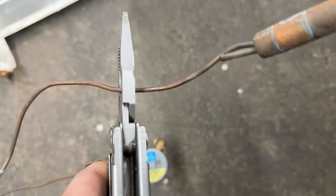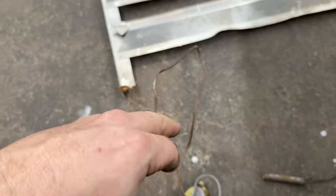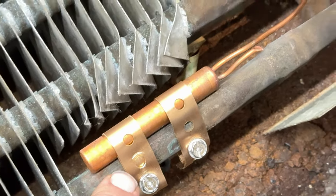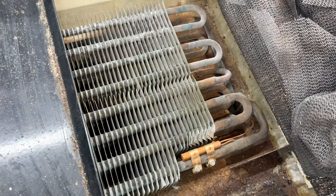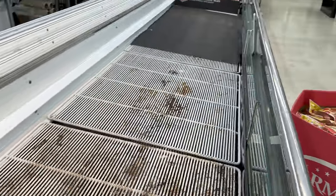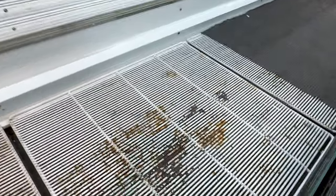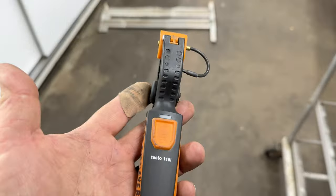Let's go up on top. There's at least one hole here — nothing else, totally dead. We got it all mounted up. You can see it's feeding quite a bit. There's no suction port, so all we can do is check temperature and see what it is compared to the back. We're going to do it the old-fashioned way — I don't know if my probe will reach that far or not, sometimes it has problems with all this metal. We've got it in place; doesn't look too bad once you get all the coverings on it. I'm going to let this start dropping the temp more — once we get down around 40, we'll check the superheat and see where we're at.